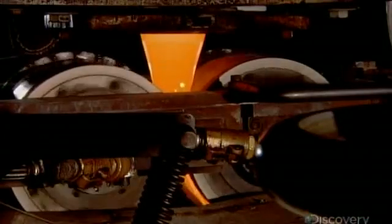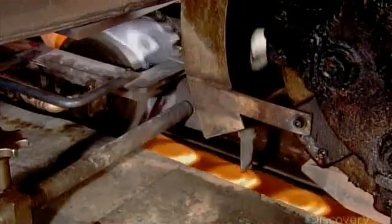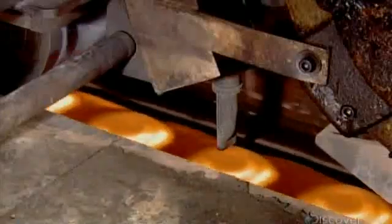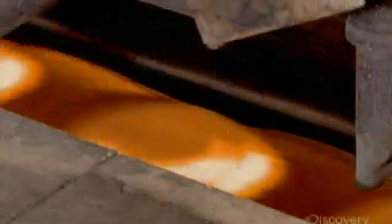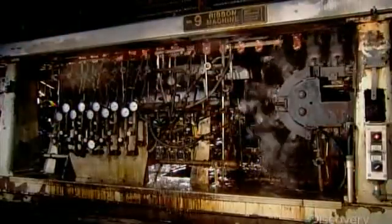It takes up to 24 hours for the mix to melt into a taffy-like glass. It flows between rollers that shape it into a ribbon. One roller has little pockets on the surface, which form the ribbon into segments. These devices, called blowheads, inflate the glass segments through holes in the conveyor chain. This stretches the glass into oblong bubbles called blanks.